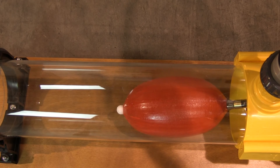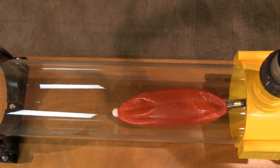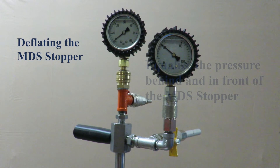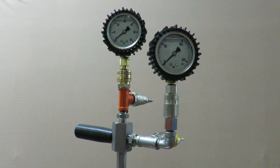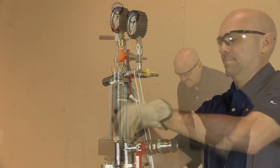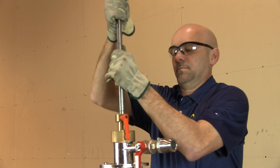When the job is done, it is time to deflate the stopper and allow flow through the pipeline. This is done in a two-part process. First, equalize the pressure behind and in front of the MDS stopper — this can be done in a variety of ways, so please refer to the manual. Next, deflate the stopper: remove the safety device and open the valve to release pressure inside the stopper. Pull a vacuum on the stopper to make it as compact as possible, then pull the pressure rod completely upwards, moving the stopper from inside the pipe up into the stopping tower.